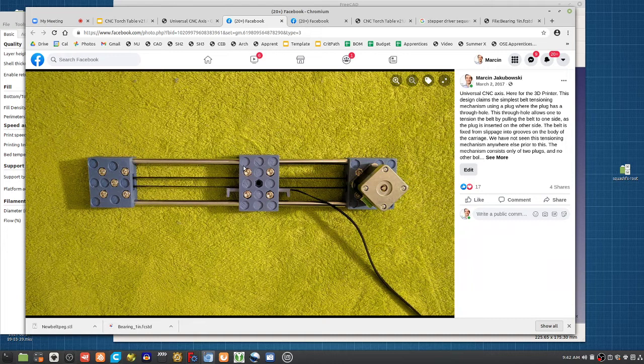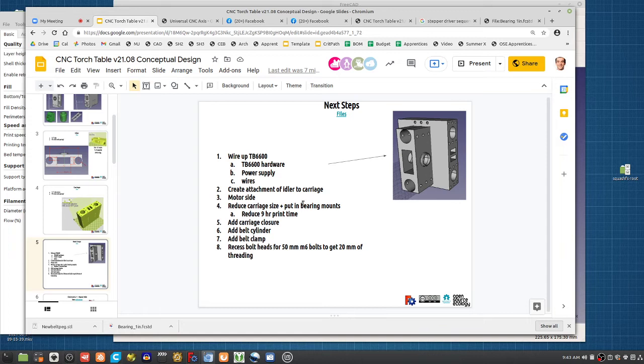And in this system here, we had double clamshell. So for example, here you need these four bolts to clamp it together. Well, that's too many parts. We just made it monolithic, which is what we've done for about a year or two. And that's how it works. So that's a brief overview of the 1-inch universal axis. We're just going to larger sizes, using larger stepper drivers, and you can use larger frames, and then you're on top of making pretty decent sized machines.